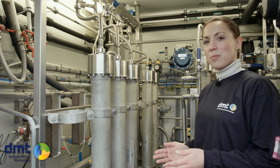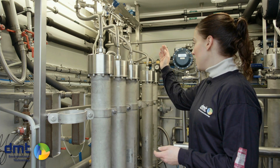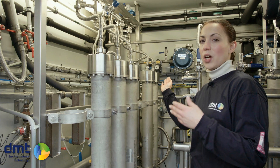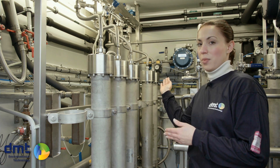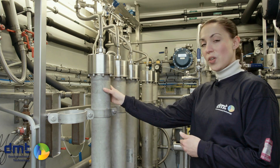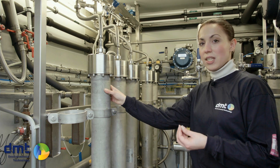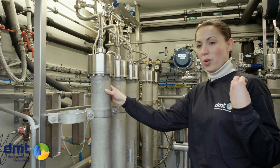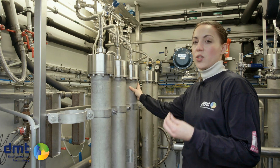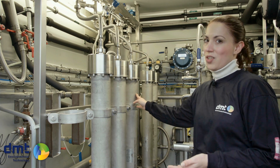The system employs a three-stage membrane configuration for optimal performance. The raw biogas exits the first stage into the retentate side having only 10 to 15% carbon dioxide. The CO2 that went into the permeate stream is treated in the third stage to recapture the methane that slipped through and recycle it into the process. The retentate from the first stage then goes to the second stage to be purified to a final concentration of 1 to 3% carbon dioxide according to the customer's needs.